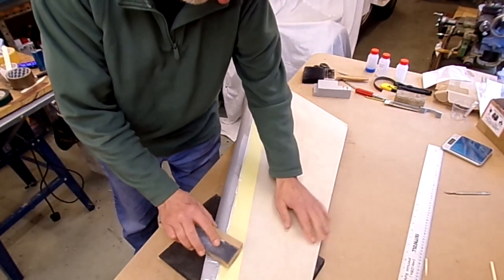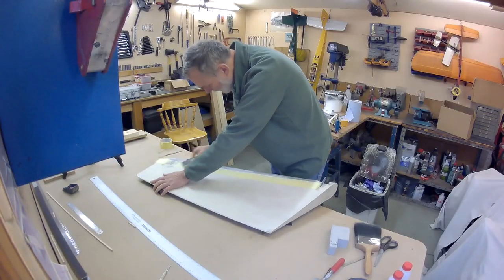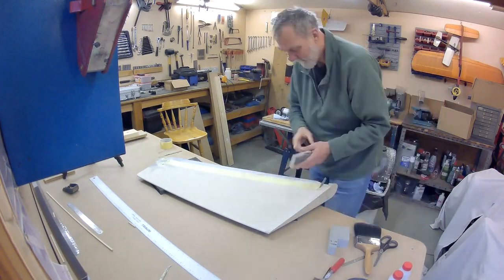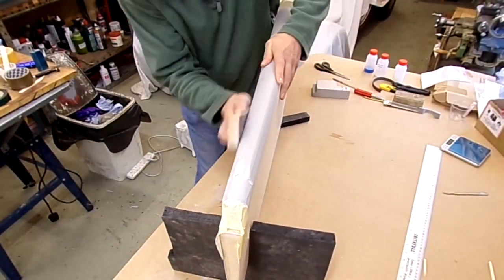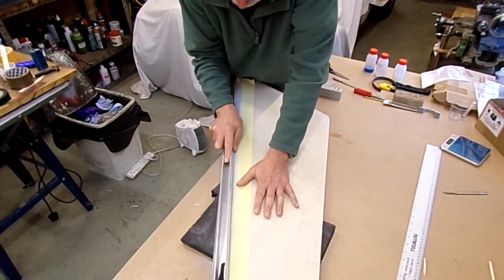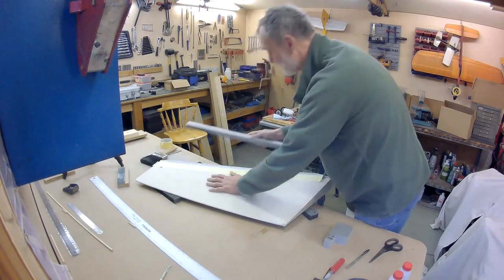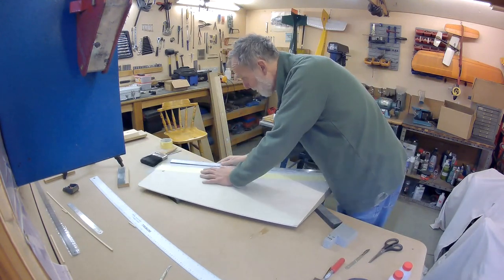So we'll just get started. A little bit of time lapse from now. So literally just sanding down using the tape as a guide, and then I use a long block, which is really just a piece of aluminium U-section with 60 grit on one side and 180 grit on the other. I feather in down to the same level as the plywood, the very edge, so that the glass fibre will actually wrap down and back up again, so there's no step.